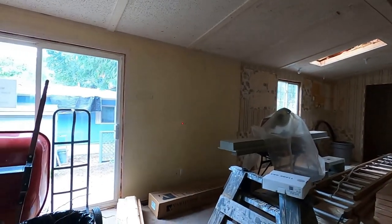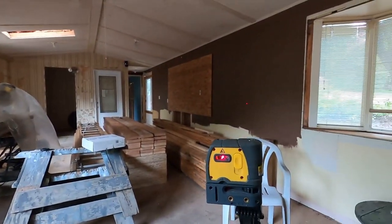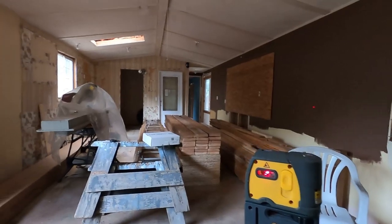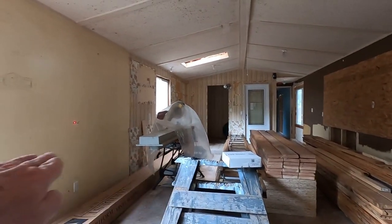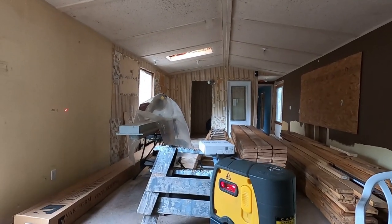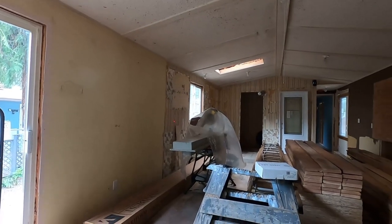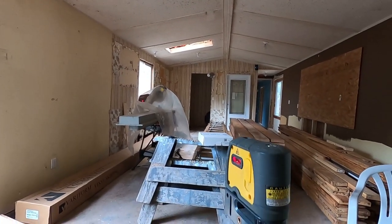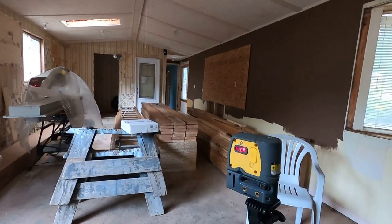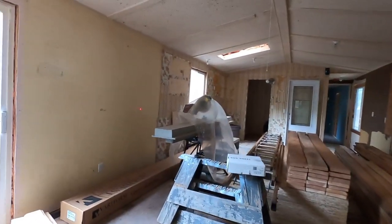What I've done — and this is the way I always start — is I set my laser up. Those of you who've been watching my videos have seen this little guy before. It's projecting a level beam out into the room. No matter where I turn it, wherever that laser beam hits on the wall is going to be level. You can get fancier laser levels, but this simple one costs a couple hundred bucks and is very handy.